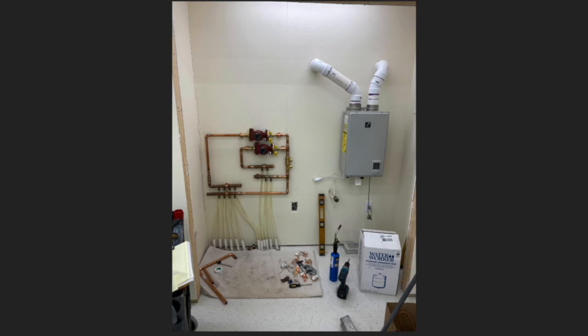So the water heater heats up the water, and the circulating pump takes it through this piece of pipe right here, and then the zone pumps, either one or both of them can run, and they'll pick up heat from that water or hot water, depending, kind of doesn't make a difference. You get the heat one way or the other, and run that through whichever zone, or both zones if both zone pumps are on, if both zones are calling for heat.